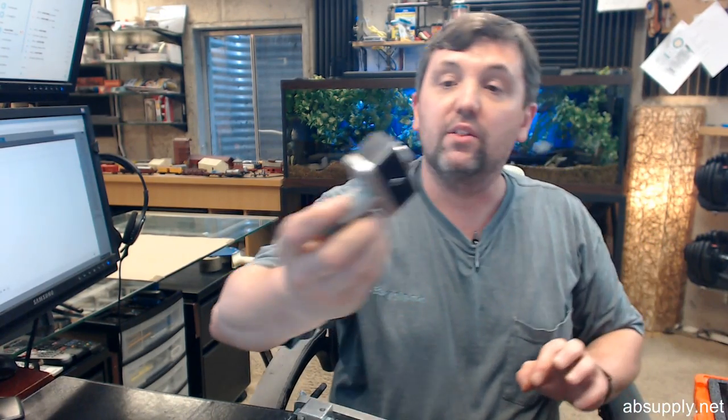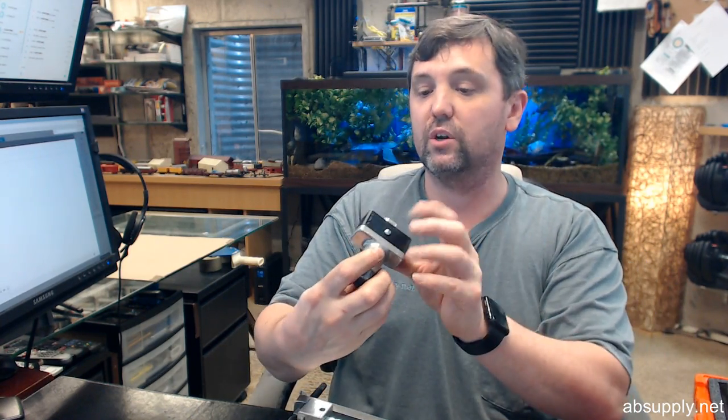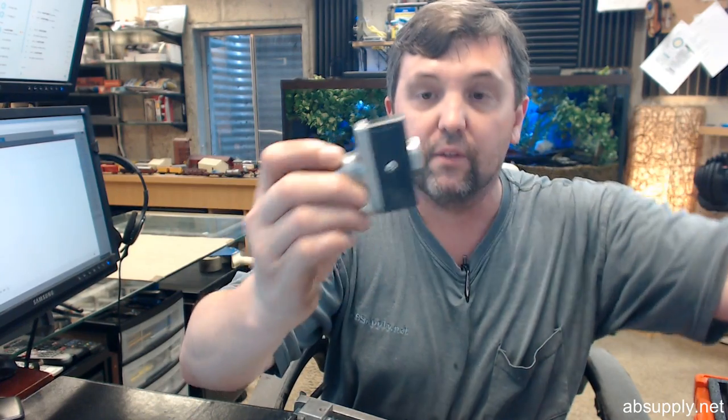Speaking of the frame, not yet. This will insert into the hole in your door. You're going to hold it vertical. You're obviously going to give that a smack. You're going to mark it. Some people will use that to get nice and deep, do some chisel work. I would like to come back and hit it a couple more times, a little deeper, do your chisel work, then it's nice. This is going to be 1 inch wide by 2 1/4 tall. Okay, 2 1/4 tall, 1 inch wide. That's your latch bolt mark.